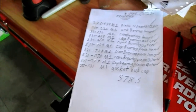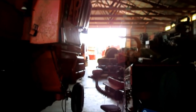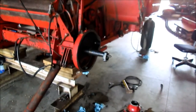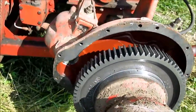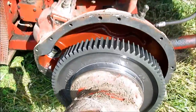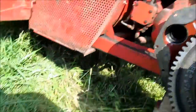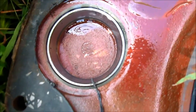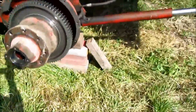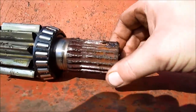So I decided that we're going to rob it out of the 550. We bought it to use — we only have $500 in it, so right there it's already paid for itself. Even if we have to take both pieces off, it only took me about 10 minutes to get that down that far. Out here on the parts machine, it literally took me longer to gather up the tools to do this than actually get it pulled — about 15 minutes to get our pinion shaft and gear. I'm actually going to use this face plate because its bearing race, this outer race, doesn't have any wear on it. Our splines do have a little wear, but they will run.